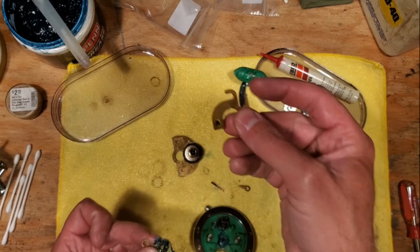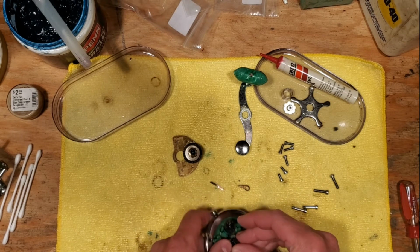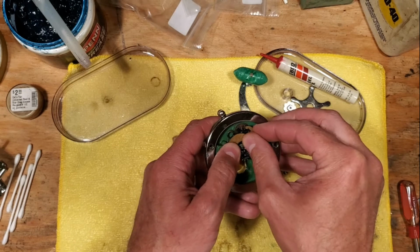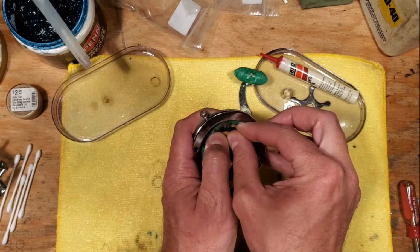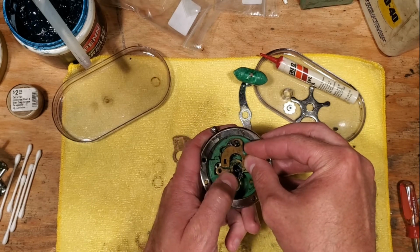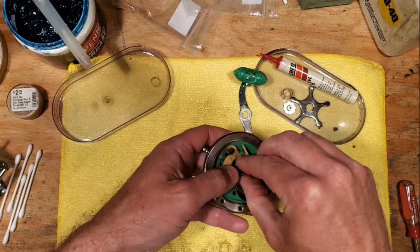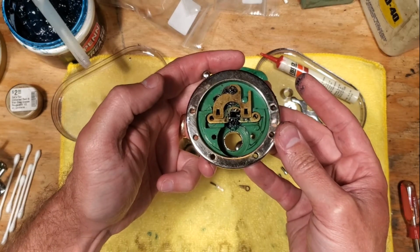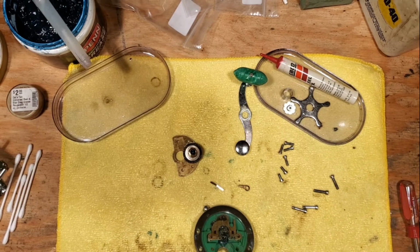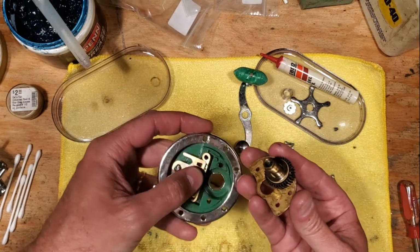And then we've got our eccentric jack. So there's a couple of different things that we're doing here. As you can see, we need to have that in position. We need to put the jack over the yoke, and then we need to line it up with our eccentric lever roller here, basically. And this can be a little hard sometimes, but that's basically what that should look like. That's real simple. Okay. And now we're ready to install our bridge with our gear assembly.